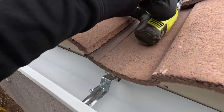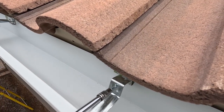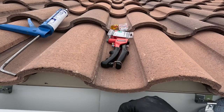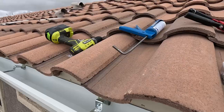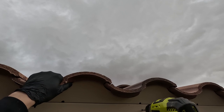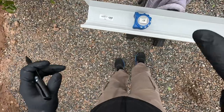I'm just sliding the bracket over to the hole and then using the drill to move those screws in. You may have to bend these brackets upward just so they attach onto the edge of the gutter properly, and I had to go back a couple of times and re-tighten them. I've got a screw near the inside of the gutter where the two meet and then two rivets on the rest of it, and then I caulked with the sealant in between.